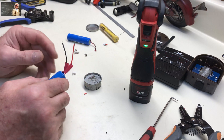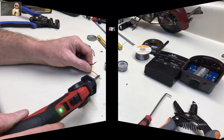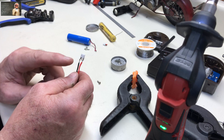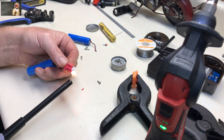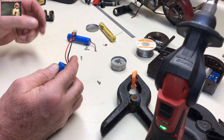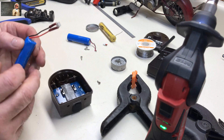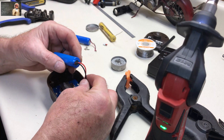Red to the red and black to the black. That's all you've got to do — now it's soldered on. You take your plug that you need, which is this one, and you solder it on to your new battery. She's done — that baby is ready to go back in. All we do is stick it back on their little sticky thing, and this only goes on one way so you can't get it wrong. You plug it back on.